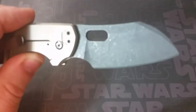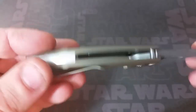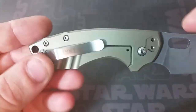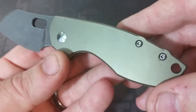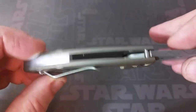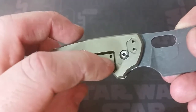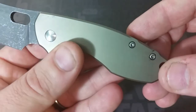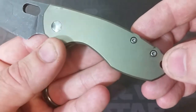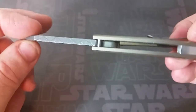Overall, I'm pretty happy with the way it came out. As you can see — and if you've been watching my mod videos you probably know — I really like to polish hardware rather than do anything fancy with it. So we polished everything and then bronzed the frame. I learned from past Pilars to just quit while you're ahead: if you get that good bronze color on stainless steel, stop there and don't try to push it for purples or blues because it really doesn't work out consistently. There are a couple of imperfections with some unevenness in the bronzing, but still pretty happy with the result. Hopefully the gentleman I'm trading with will be happy too — it ships tomorrow.